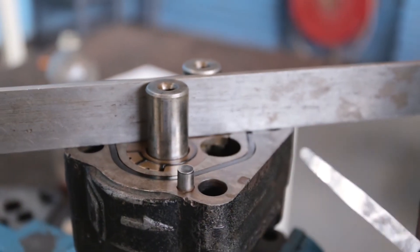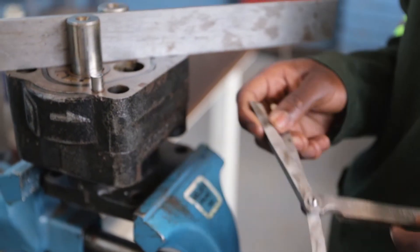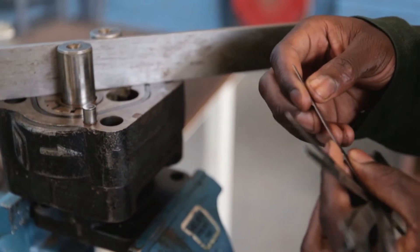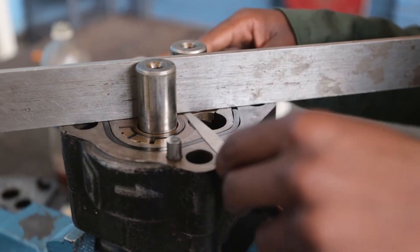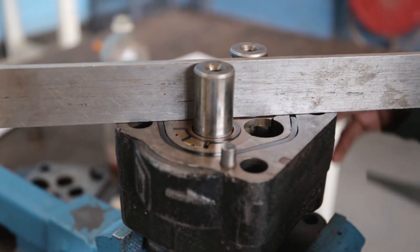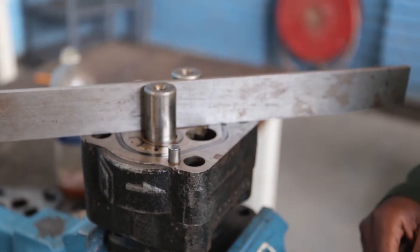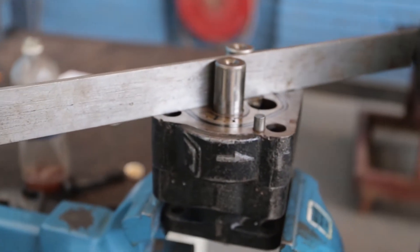So this one, I think it is not just the one. So I am going to get the next one — it is 0.2. This is the one that is showing the clearance between this and the straight edge. So I am going to record this as the clearance, then compare with the manufacturer's specifications.